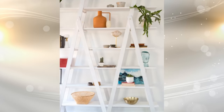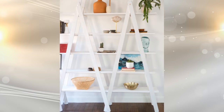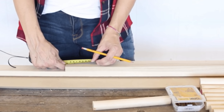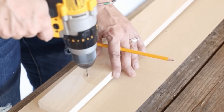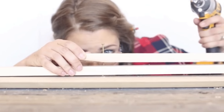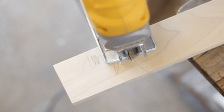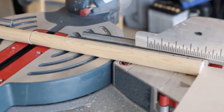2. This is a combination of stairs and shelves and is perfect for the dining room to store bowls and other utensils. For the long side, take your first board and measure down 4 inches and mark. Take a small drill bit and drill all the way through your board on each of the marks. Take your short board and measure down 2.5 inches and drill all the way through the board. Use a roll of tape to mark the arc for the edges and then a jigsaw to cut the excess off. Cut 7 dowels for each side of the ladder.